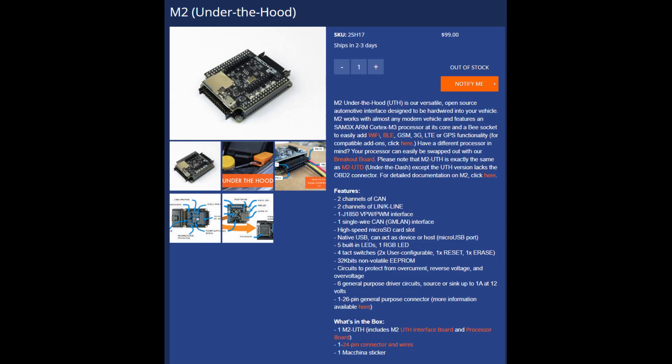Now that I know how to get the data I need from the car, I need to figure out how to display this information in an intuitive and non-distracting way. I'll need a microcontroller capable of sending and receiving CAN messages at high speeds that can survive the harsh electrical environment in a vehicle, and should be compact and easy to wire in. With two CAN bus interfaces, an onboard voltage regulator, and a compact design, the Macchina M2 is the perfect candidate. As a bonus, the dual CAN interfaces will allow me to send and receive data on both the high- and low-speed buses.